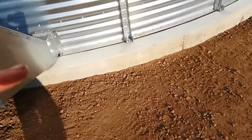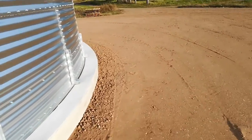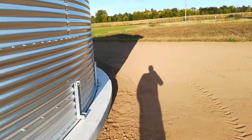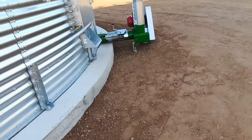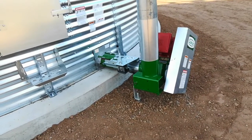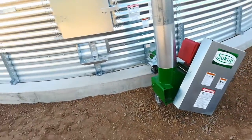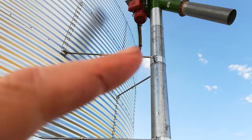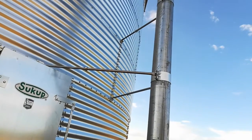You can see I'm happy with how the elevation came out over here — showing about eight inches of foundation. But between the bin constructor and the excavator, they didn't do me a whole lot of favors over here. I spoke about the positive things; this is one of the negative things. I would have liked a little more room underneath that, and that's going to have to be what it is. I think that bracket should be up another three feet or so, as high as it can get on that auger, just to give it more stability.